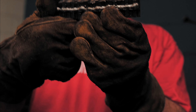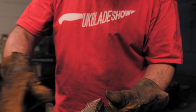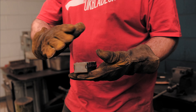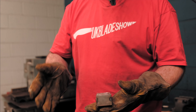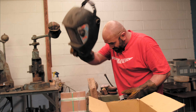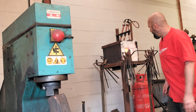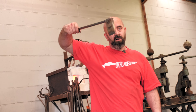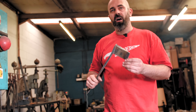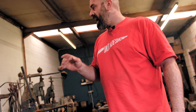So that's our billet at the moment. It's more even down one side than the other because the cuts weren't perfectly straight. What I'm going to do is weld it up and give it a little whip over with the grinder when it's hot to make sure it's nice and even, so when I forge it on the sides it's going to be nice and even. Chuck this in the fire, get it hot, smash it with a hammer — long and short of it. I'm going to cut right down the middle but before I do that I'll chuck it on a handle so I can feather it, adjust it, and make sure it's all straight.